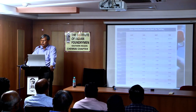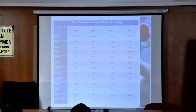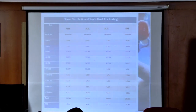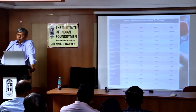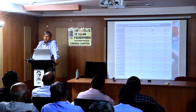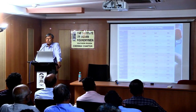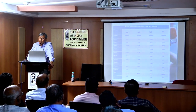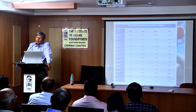Now is the concluding part, the sand test, which I have already told you about. In most cases, we specify the AFS number of the sand and say that at this AFS number, a certain strength should be given. But you must have experienced that AFS number is only part of a big story. Sands with the same AFS number will have 10 different characteristics for strength properties, because many parameters are involved, like morphology, structure, coefficient of angularity.